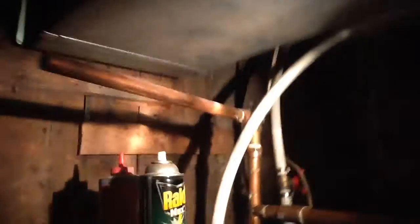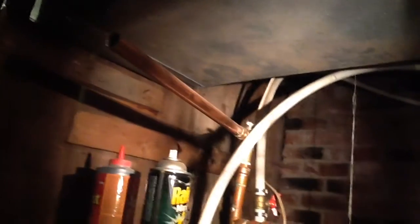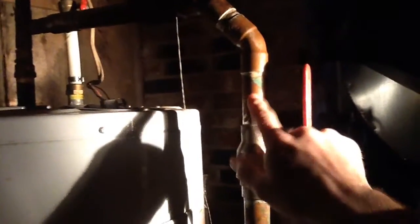There's a pressure release valve up top there — the silver thing — right at the top of the pipe. You have to open that pressure release valve and vent the air that was at the top, because the air lock was preventing the water from circulating. Once I released that air, the thermal siphon was able to circulate up through and around.